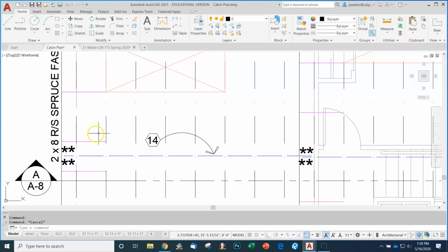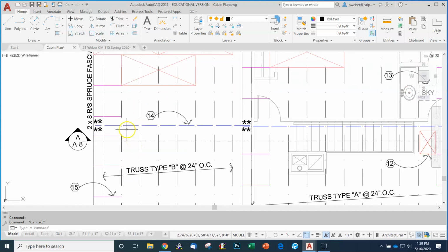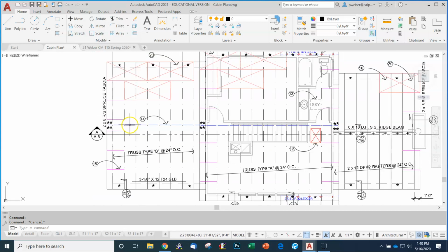What you'll have to do is offset a truss 2 inches, and dead center between this fascia and this fascia, put in kind of a 20-inch block of wood here. Then copy this with OSNAP turned on. Copy this starting from, let's say, the tip of this truss to the tip of this truss to the tip of this truss, and you'll bust out a whole bunch of blocking for the trusses.